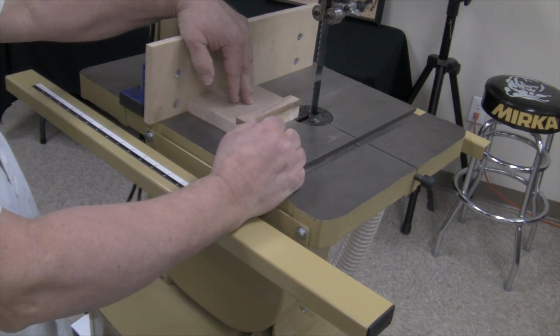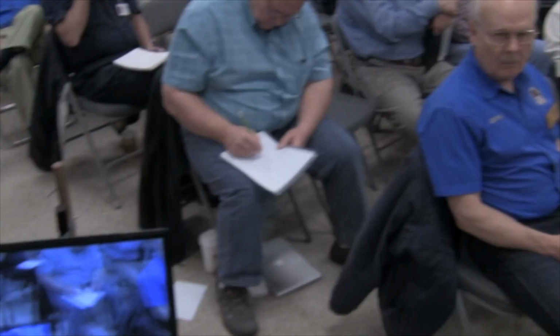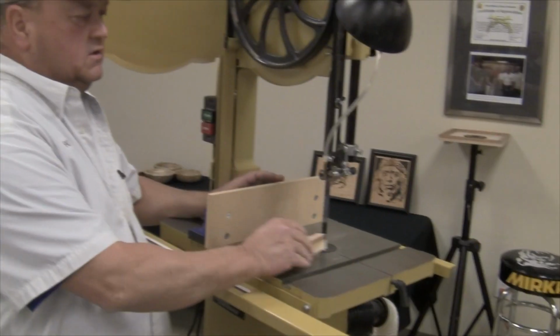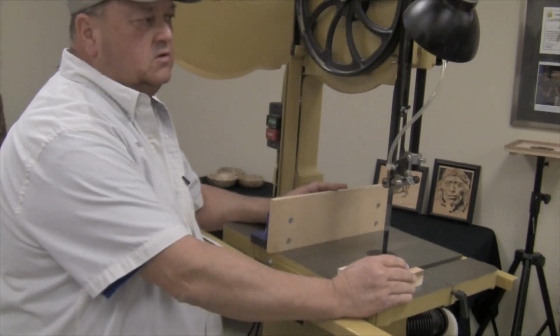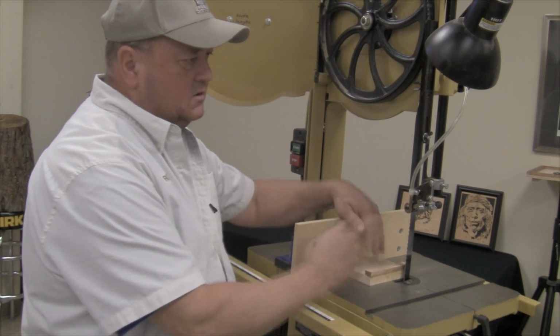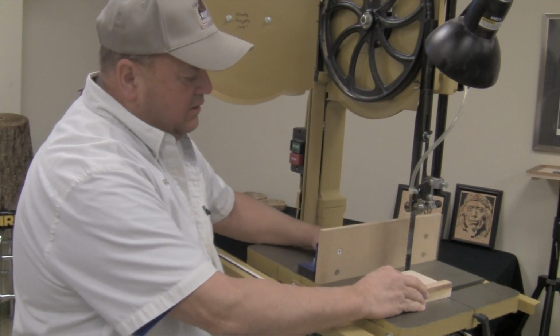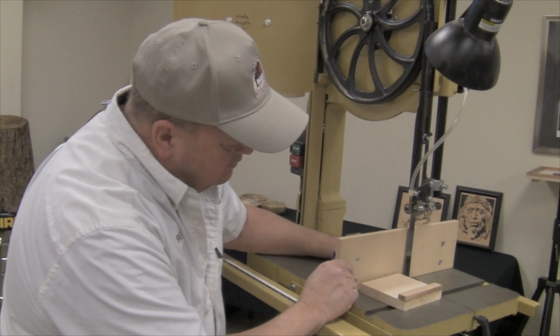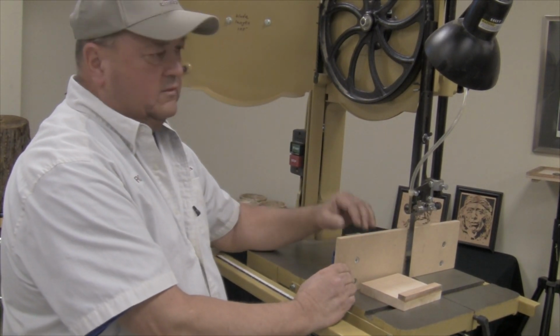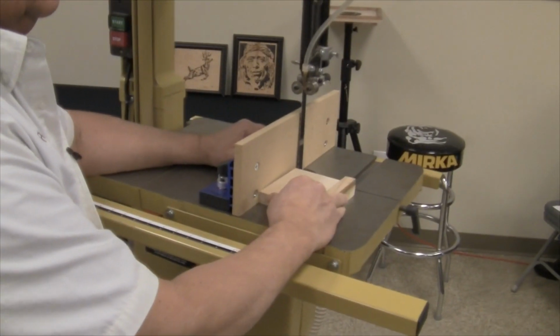I do just the opposite, and I think it's just a matter of preference and what works for you. Is it six in one hand, half a dozen in the other? I think so. Actually, I think it's a matter of the thickness of the wood. If I'm doing like a 1/4 inch, 1/2 inch or something like that, I've always got the wood on this side. But if I'm trying to do a thin layer, you're just taking layers off, then I put it over here because everything I put on there is going to drop off. If you're doing something like a 1/16, and you're only taking a 1/16 off, and you got that close to there, I've done that before, and actually, my metal fence itself, I've actually cut into it, because as I'm going through here, it came through and just hit the fence.